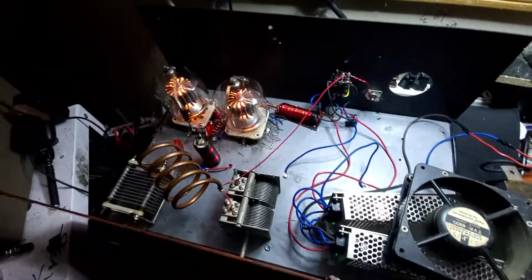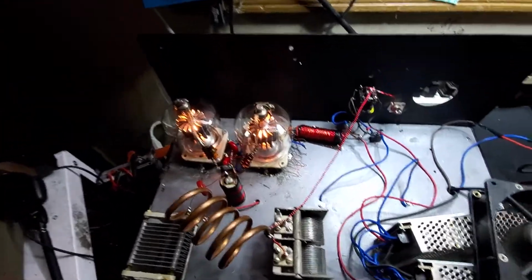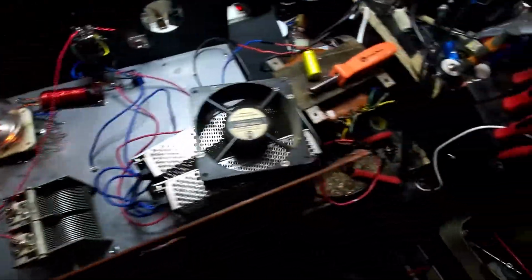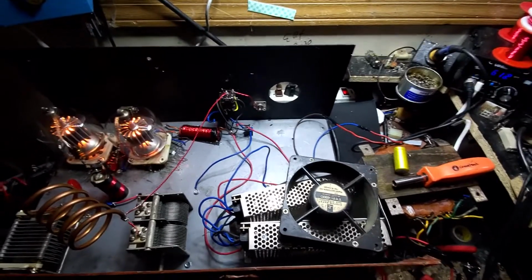3-500 ZG amp. We stand behind the chassis of all our amplifiers for a lifetime. We do not cover tubes. However, we do cover the transformers. Most guys won't cover the transformers because a lot of guys will build this amp under the platform of a single envelope transformer that has high voltage filaments and everything coming out of one envelope.